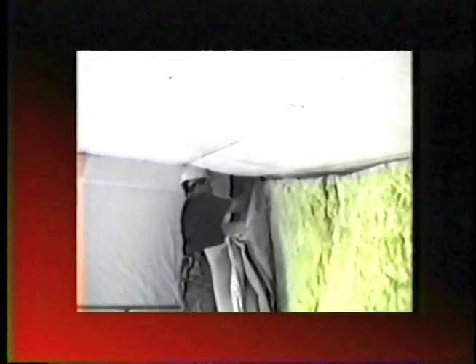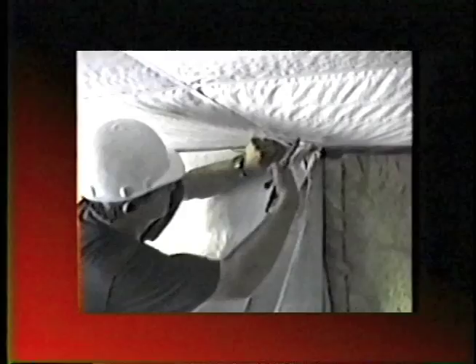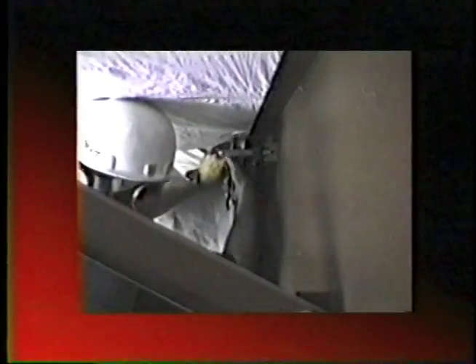Position appropriate sized fabric on wall. Factory seams should run vertically on wall fabric. Start positioning in the upper left or right corner at rafter and roof intersection. Position fabric over eave-line strap and clamp with vise grips. Proceed to the opposite corner and clamp fabric there also.